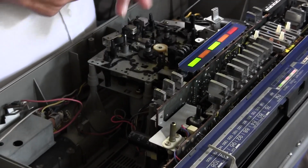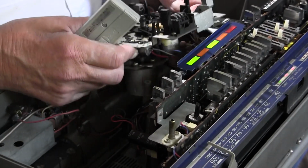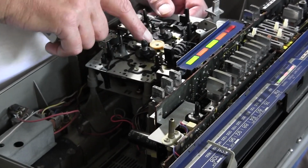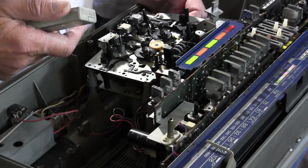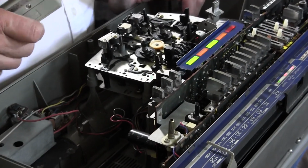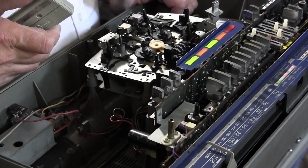Anyway, I'm at my wit's end here. I don't know why the cassette deck mechanism is goofy, but it is. And why this won't go left or right to engage either spindle for the take up or fast forward or rewind. It just won't do it. The motor spins, the gear spins, but it just won't go left or right to engage that. I just wanted to explain that to the world about this model.